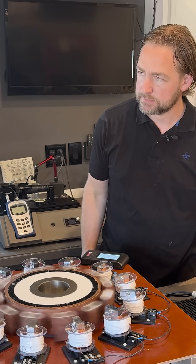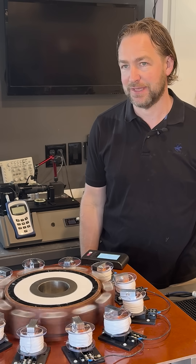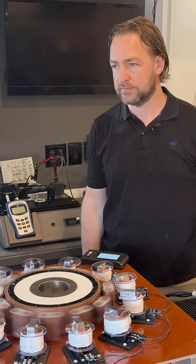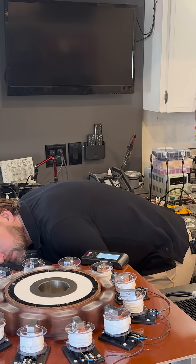Can you tap current from these coils here? It's about 9 volts so far — not a whole lot. It's AC. And what's driving it is underneath, and that is not mechanically coupled, it's magnetically coupled.